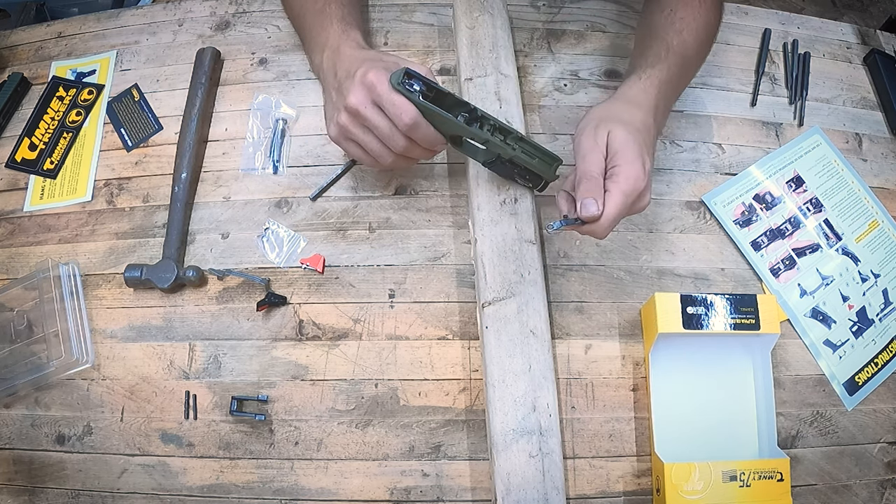A few minutes later — quick update. I had a bit of an issue after I got everything put back together. The trigger felt fine until you tried to reset it, and then it didn't reset — you'd release the trigger and it would fire again. Obviously it didn't actually fire a round because I'm just testing with no live ammo involved. I figured out the problem: it was the aftermarket connector bar. I took that out, put the factory connector bar back in with the silver spring, and now it works correctly. If you have an issue with what's essentially binary fire, double check and make sure your connector bar is the factory one. You'd probably know if you ever changed it out, but if you got the gun second hand, double check.